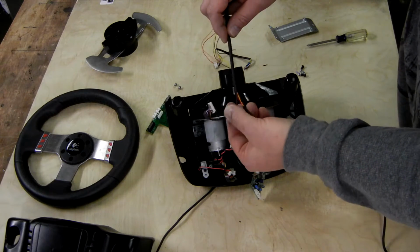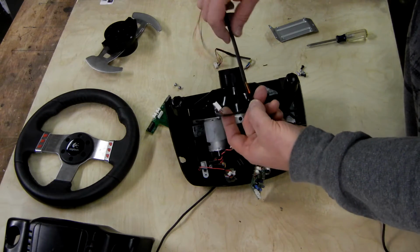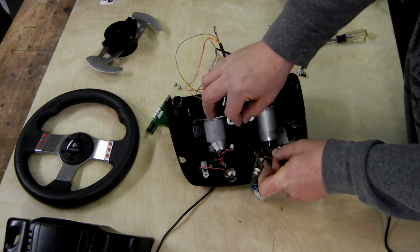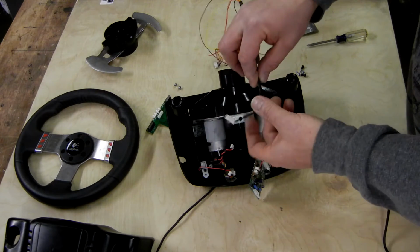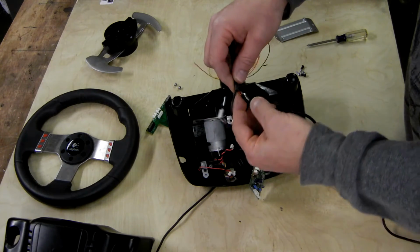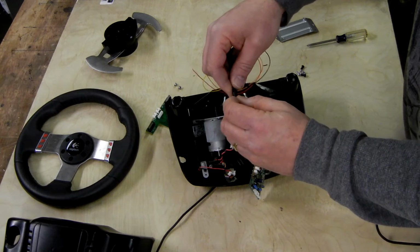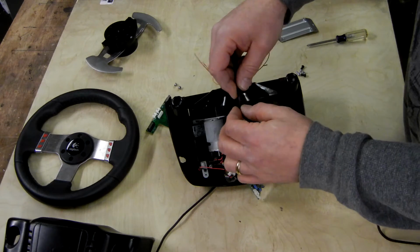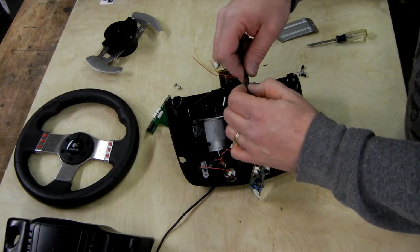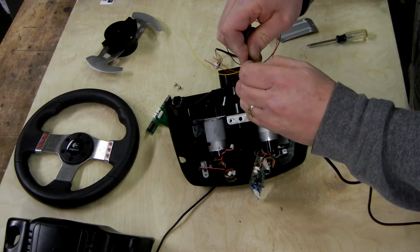So you'll see there's some curvature in the cable there. So we're going to run our new cable up about like that. That's kind of what we want coming out of the wheel there. You want to get your new cable where it's stripped back up underneath the heat shrink. If you can't, add an extra pair on there, because you don't want the wire to be loose and breaking there. So I'm going to try to squeeze this into the existing heat shrink.